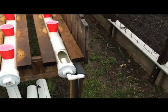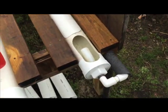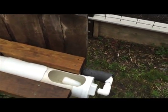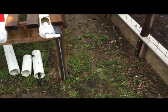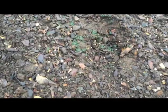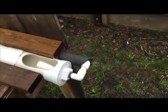The next day and I have a problem - my water stopped filling. The little flotation valve failed. I think it filled up with algae. I thought I drained the lines over the winter but they just stayed static. This system is plumbed into the same line as the other one. When I opened it - you can see all the green algae that came out. I bounced the valve a bunch and I can't get it to clear and I have no way to service it, so I'm going to cut the PVC pipe and unscrew it.